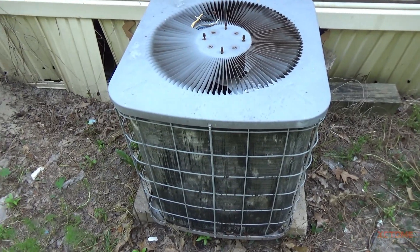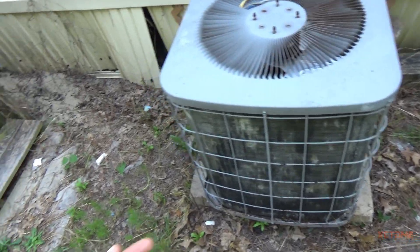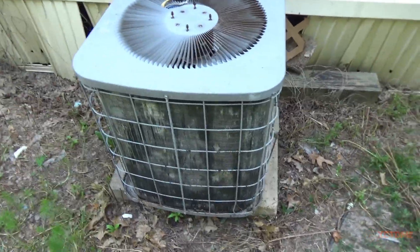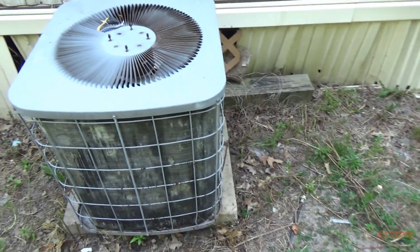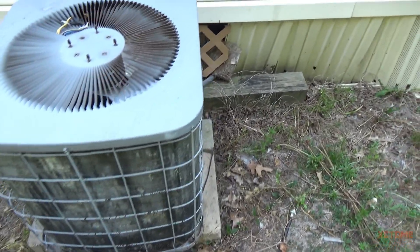He took and washed it off. I didn't have outdoor plumbing at the time — meaning spigots where you could screw a hose on. So we had to take a mop bucket and splash this thing with water to get the coil cleaner off of it. But once we washed the coil, it could hold onto that liquid line all day.